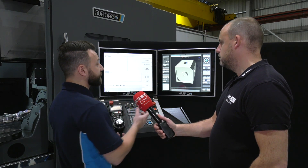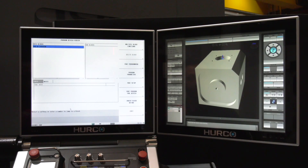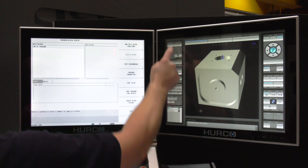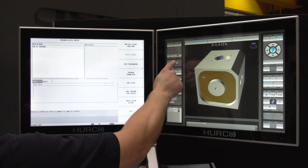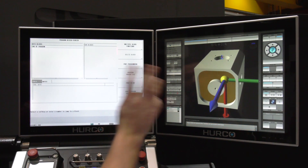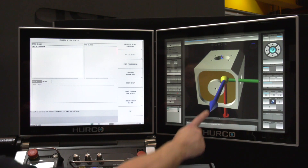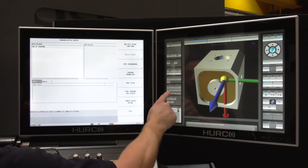The new version of software has this new panel down here. We have a 5-axis step file, so I want to bring in some of these geometries. I want to bring in this pocket just around here, so I'm going to hit my picker and select the pocket itself. I want to bring this in as a mill contour, so I'm going to select my block just here. The Solid Model Import will automatically calculate transform planes for you — and that's what you're seeing just here. I'm happy with that transform plane, so I'm going to accept that.